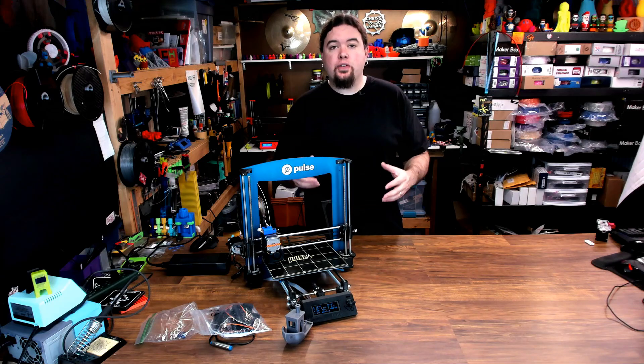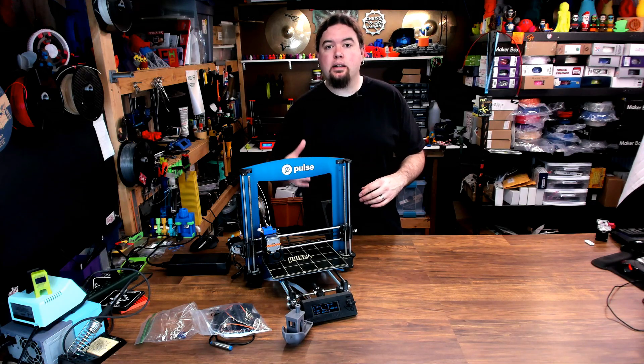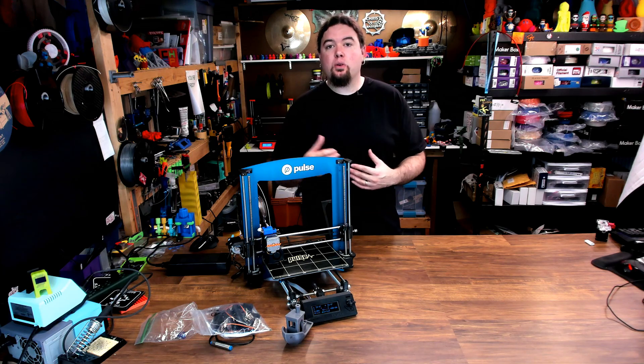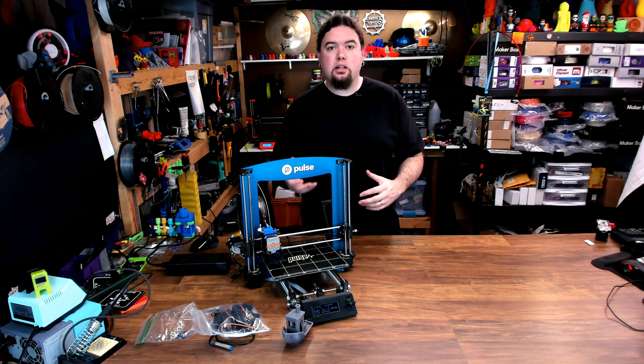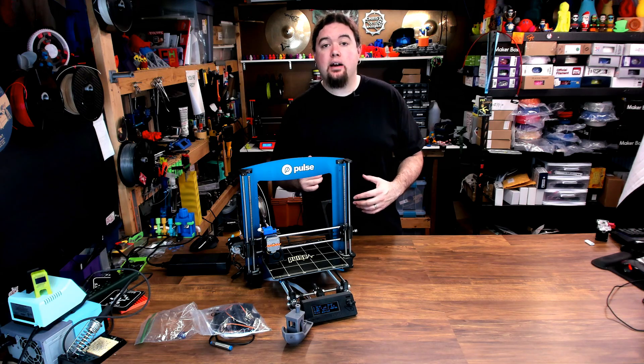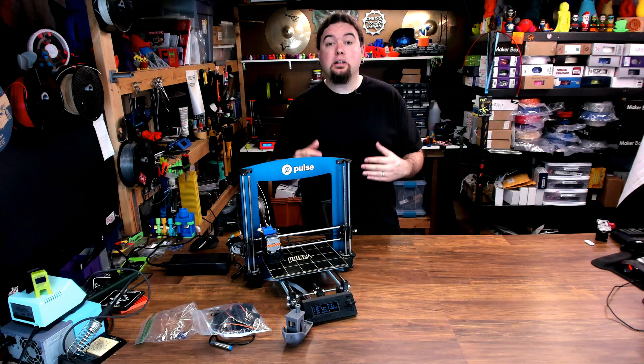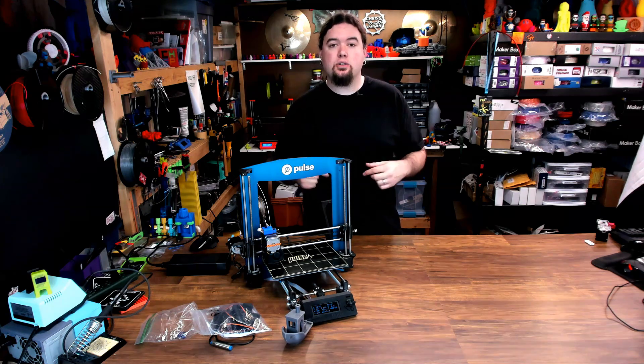So that's all for the hardware, but I did do some pretty extensive firmware tweaking to get all the features and the performance that I wanted out of this printer. I am using Marlin 1.1.9, and you could use the original Prusa firmware and eventually get it to work, but you're going to lose a lot of the features that Marlin has nowadays, including Linear Advance 1.5, and that's a feature you definitely want to have. I will leave a link to this configuration in the description below.